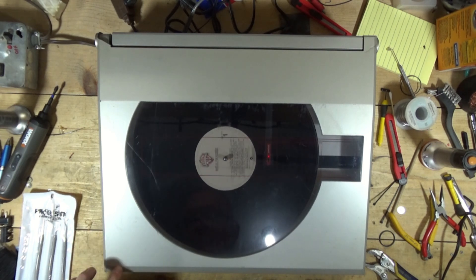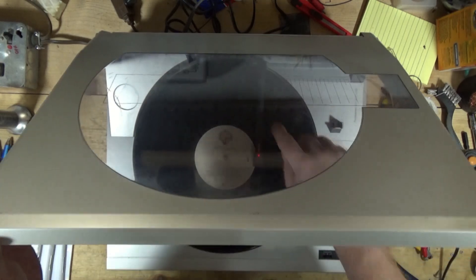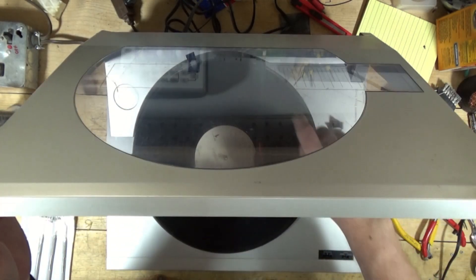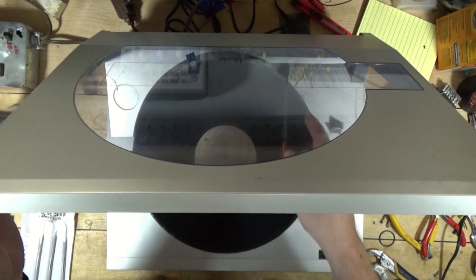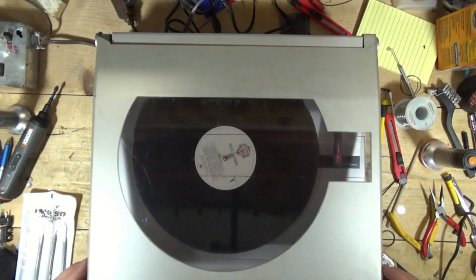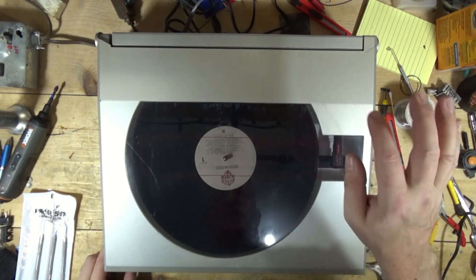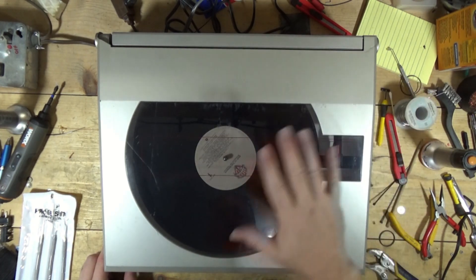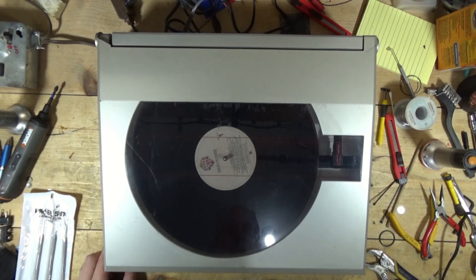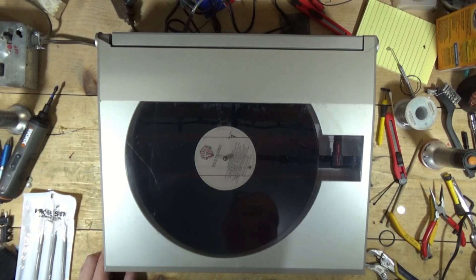It's not going back. Okay, so I do have a problem to sort out. It's that belt — the belt for raising the arm. The tone arm wasn't up. Once I tapped it, it raised the tone arm and then it went back. I'm going to assume it's the belt. Once I get a new belt I'll put it on, then test it. If there's another part, that means something else was wrong. I'm going to call this, at least part one, good for right now. As always, if you like what you see, hit Like, hit Subscribe. Catch you in the next one.